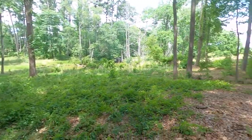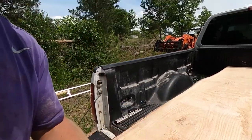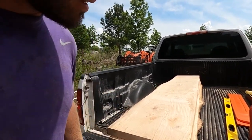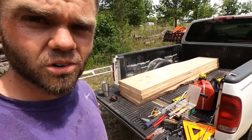I hope you guys could see that - that was pretty cool. Well guys, I'm dirty and sweaty and I didn't get as much wood as I'd like - I actually ran out of gas; I only had a half gallon left anyway. But I got four boards. They're all about 17 to 18 inches wide and I cut them two inches thick. I'm going to run them through the planer to make sure they're all square. My chain was really dull by the last board, but I'm going to take these up and cut them with the table saw, then run them through the planer and figure out the dip bar and pull-up bar.